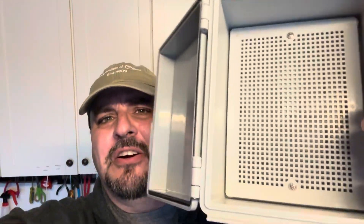These are the data boosters — I'll take them out of the wrapper so you can see them better. These are installed in line between your controller and the lights, so you go from the power supply to the controller to the lights. When the distance between the controller and the lights is too great, you put in a data booster. That means the data booster will be outside in the weather and will get wet, so I need a waterproof box — and that's what this is. This box is plenty big enough to hold my two little data boosters.